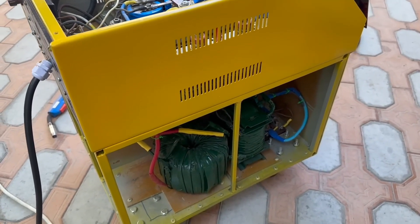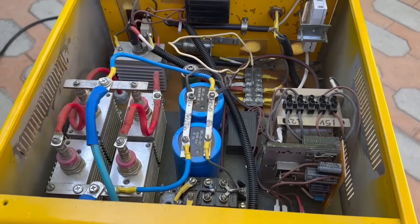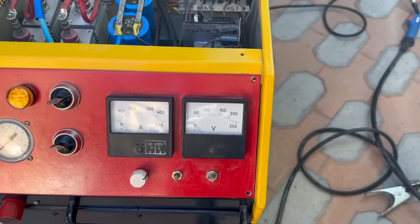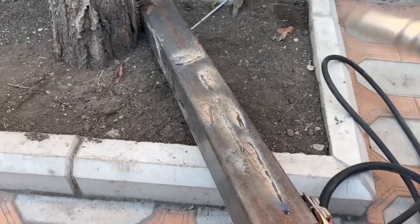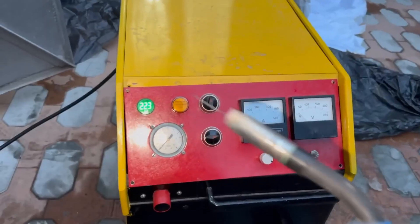At this stage it isn't completely finished. All that remains is to stretch the hoses for the gas supply and add a couple of thermal fuses. The device can work both with and without gas, with flux core self-shielding wire. For the entire period of operation I use the latter option, although welding without gas turns out so-so — there is a lot of spatter.